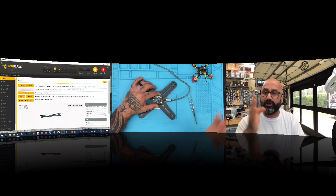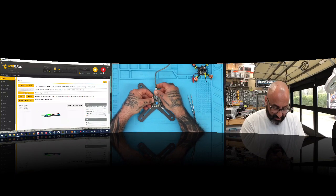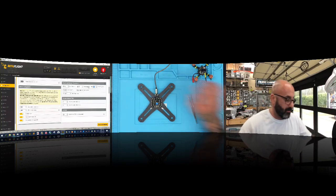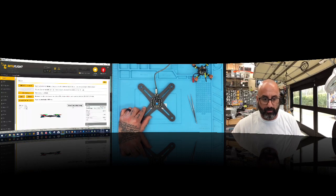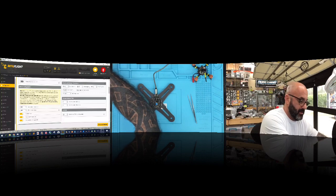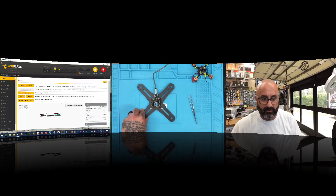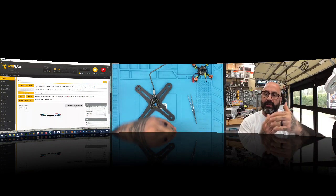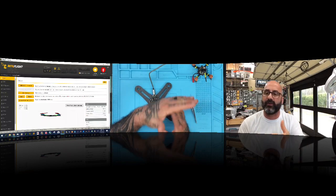You're going to stop at the 180-degree mark. If you take this board and turn it so the XT60 is facing the front and the front of the board is now facing the back, go to Configuration and pick positive 180, click Save. When it reboots and you connect, your board orientation will be spot on. Also note that positive 180 and negative 180 are the same — click Save and the result is identical. At the 180-degree mark it doesn't matter which sign you use.